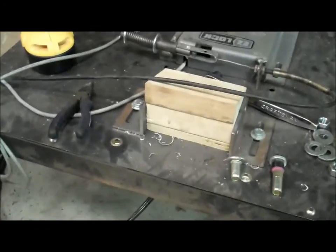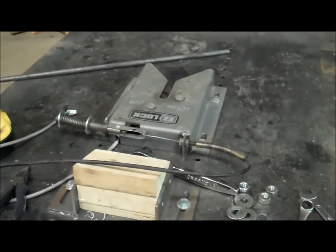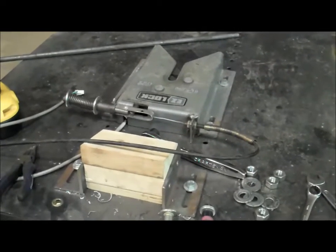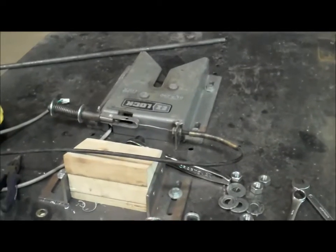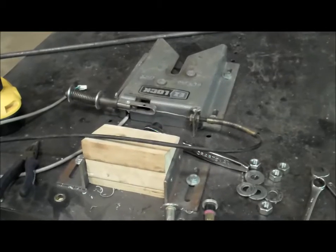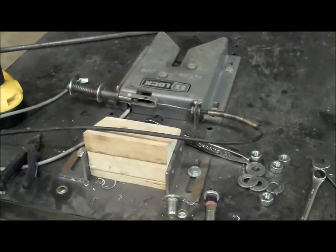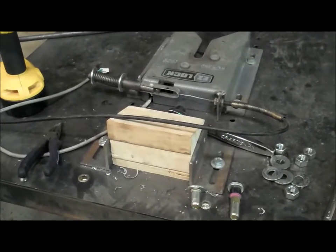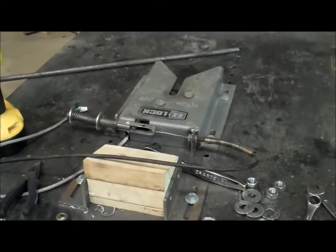And so I'm going to put those in where this wedge and that easy lock go on, and that way if I need to adjust this I can just loosen the bolts from the top, slide it, tighten it back up. The position is very close to what it needs to be for optimal from when we tested. So I'll probably put a nutsert in at the location of the current bolt, and then one before and one after in each spot, just to have some adjustability there if necessary. And if I had to go beyond that, then I could just put a nut in from underneath.